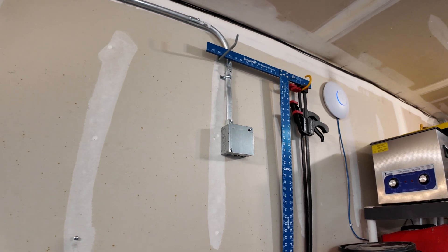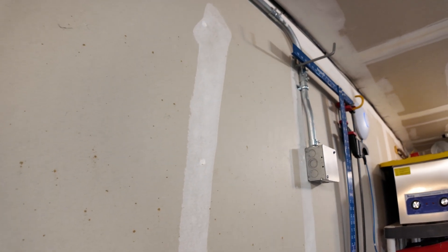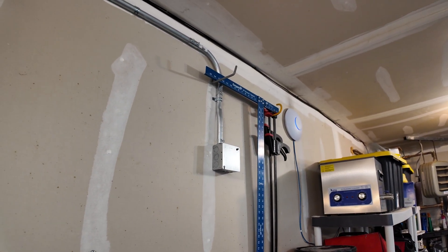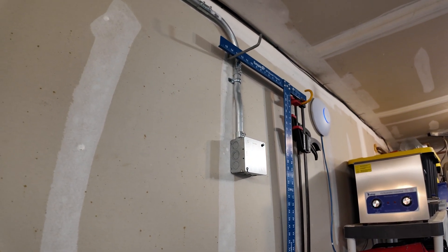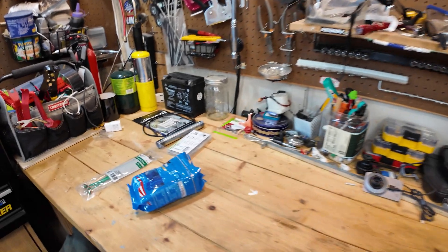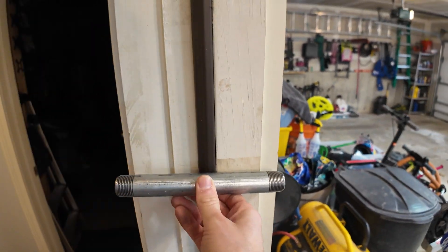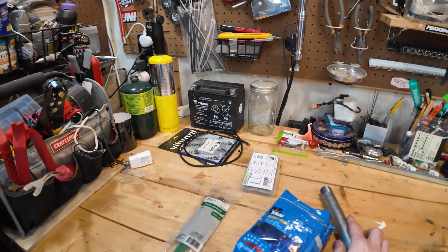From there we came to another junction point where we had to poke through the wall. We wanted to test out a bending tool and were able to make one that worked well, especially since we could see the offsets were making it tighter. We ended up getting another four-inch junction box there. To get through the wall you need a nipple with threads — this is an eight-inch nipple which works for two-by-six construction. If you have a two-by-four wall you probably want a six-inch nipple.